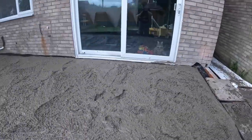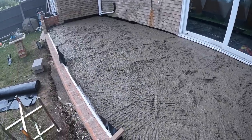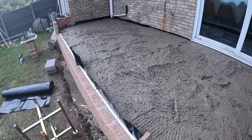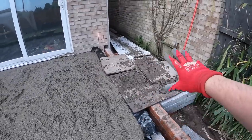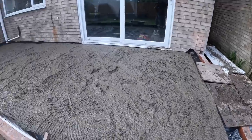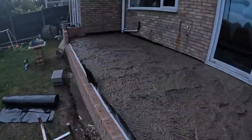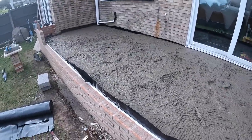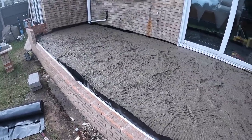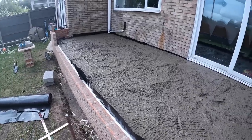There you have it. I think our friend approves. One nice concrete slab is in. So we're gonna let this go off a little bit before we tamp it. So in the meantime, we're gonna clean up all that sludge, and once that's all done, gonna finish up the break, and then tamp up all that, get it floated, and we've got places to be today, so we're gonna be buggering off after that. So tomorrow we'll be cracking on with that brickwork.